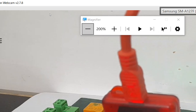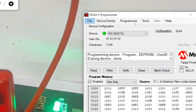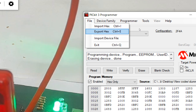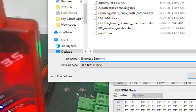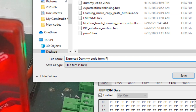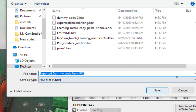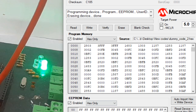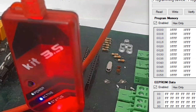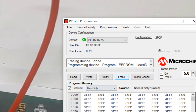Now I'm going to export the code. Suppose we don't have the original file — this is the code we need to export. Click on File, then Export. Write the name of the exported file — I'll name it 'exported dummy code from PIC.' Whatever is in the PIC will be exported as a hex file to your computer. Click Save. The file has been exported. Now I'll erase the original code — see, the original code is erased and the LEDs are no longer working.